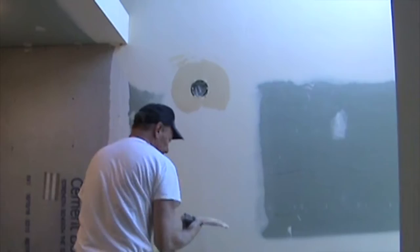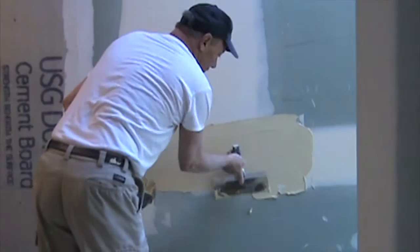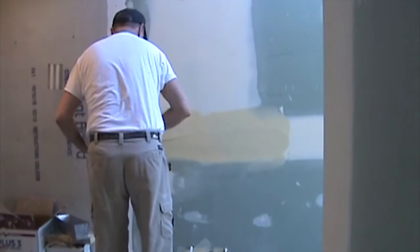So now I'm going to skim this. I always like to do the seam first — I always like to coat the seam in. So I will coat this in first and then flare my edge a little bit lighter than the original seam. I'll flare that all in, wipe that out. That's a very nice seam right there. That looks really easy to sand.